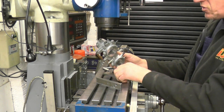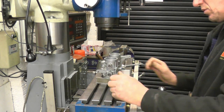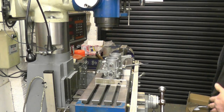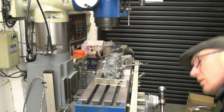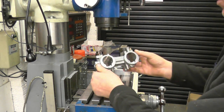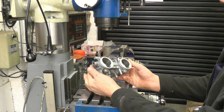I'll put them up on a couple of parallels so I've got enough clearance to bore right through, and set them up and clamp them and then set it up at centre height so we can get a hole all the way through. There's only a small amount of clearance on the bottom, across there and across there, where I can put the parallels and a couple of clamps.